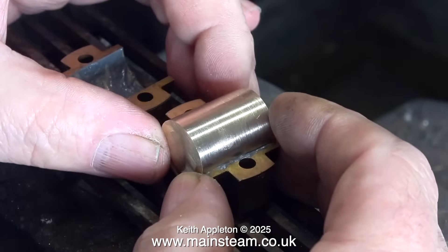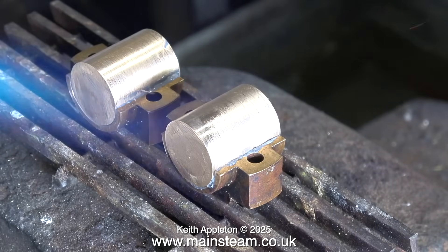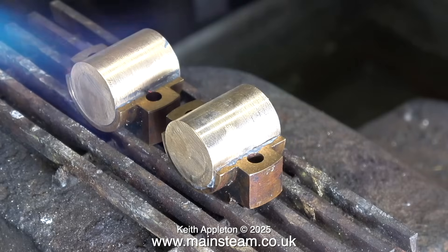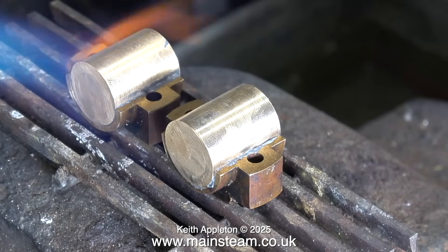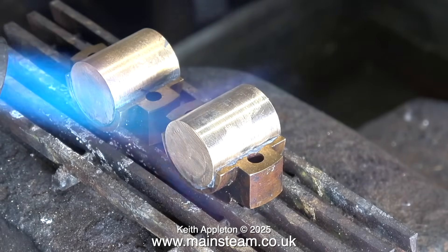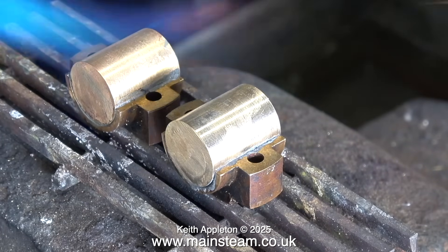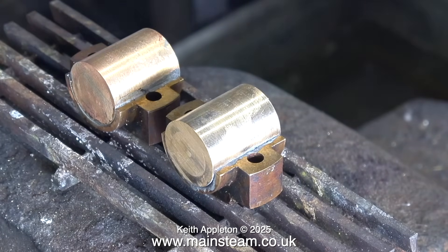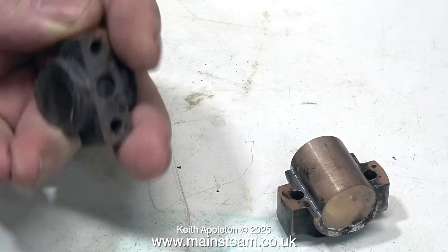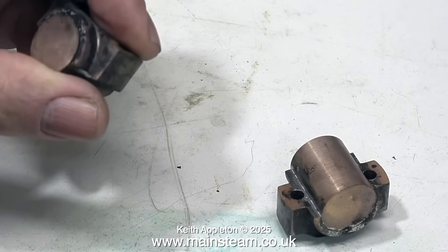As you've just watched, I've coated the brasses using some Fryer Luxe paint. What I didn't show was that I've also added some ordinary flux, so this will be a really good soldered joint. Don't forget this is soft soldering, not silver soldering, so the parts do not need to be quite as hot — just hot enough to melt the solder. In fact, both of these pieces of phosphor bronze are very well soldered into the gunmetal brasses. I'll clean them up later.